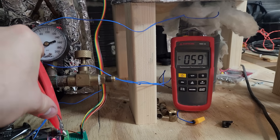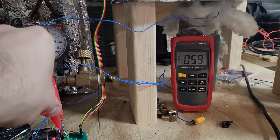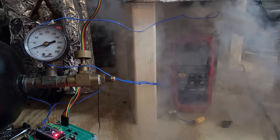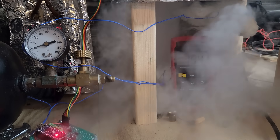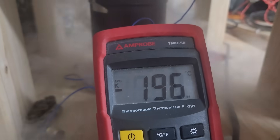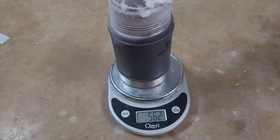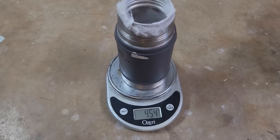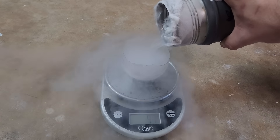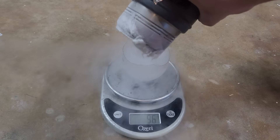I short the terminals on my board to trigger the valve controller to open — I need to wire up a button for that. And there it goes, we've got some liquid coming out. The K-type thermocouple output gets a little fuzzy at this temperature and reads between minus 194 to minus 196°C. But yes, we've definitely got liquid nitrogen now. My thermos weighs 562 grams versus 454 when empty, so I've made 108 grams. When I dump it into a little plastic cup on a scale, you can see how quickly it loses mass to evaporation without any insulation.